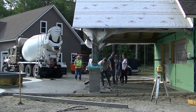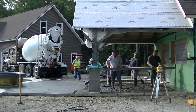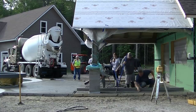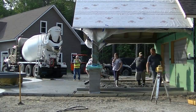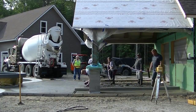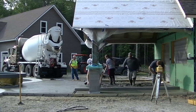They've got half of it screeded now. They're going to screed that last bay and then finish dumping a little more concrete. With about a 14-foot straight edge, Darren puts the end of the screed right in the center of the drain, screeding uphill about an inch and a half to the high point, and then it goes back down to the other trench drain.